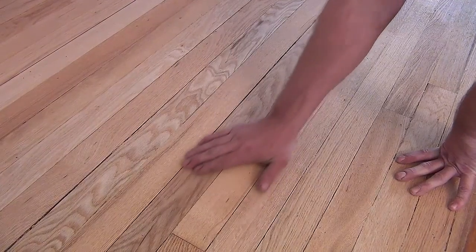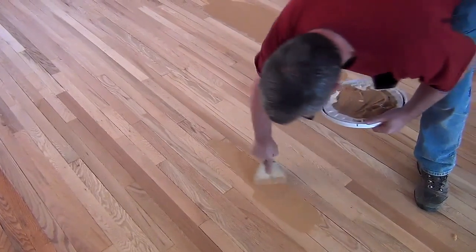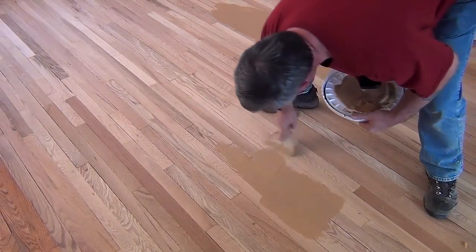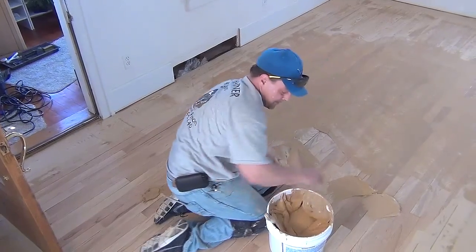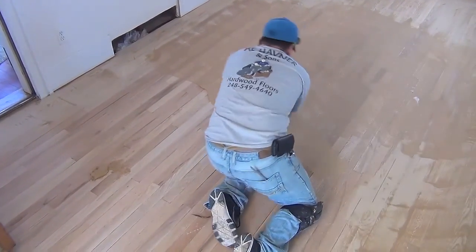And what about those Grand Canyon cracks in the floor? It was obvious no filler was even considered by the handyman. Here the finisher hits the heavy ones prior to trowel filling the entire floor after the first complete pass with the drum sander.